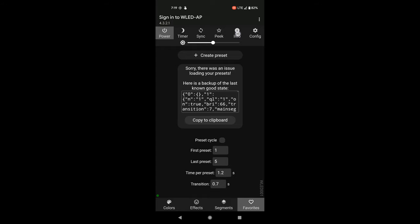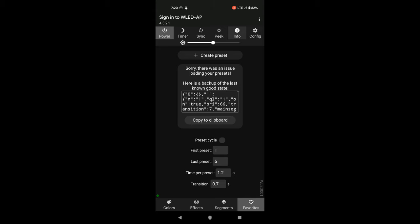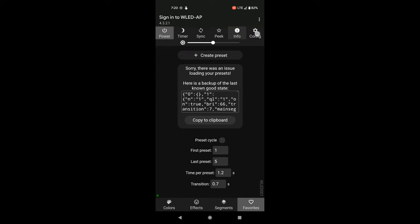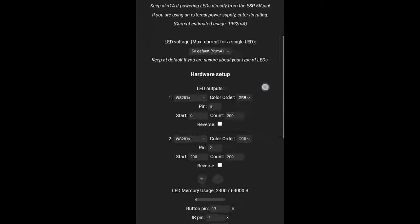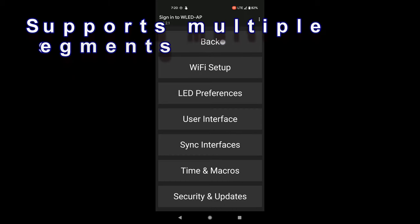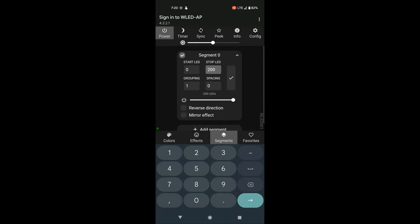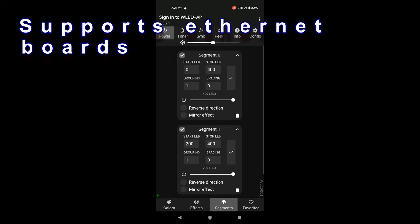The real power of this actually came about in April 2021 with the build of 0.12.0 Hikari, and it added three different features that make this a good addition to your home show. The first is it supported multiple pins — before the 0.12 build, you could only control one set of lights from one output pin. With this build, you can actually control multiple pins; here you can see I have two pins on pin 4 and pin 2 where I control a different set of lights. The second feature is that you can split them into segments, so rather than controlling a single stream, you can add another segment and run different patterns on different segments. The last feature it introduced is actual support for Ethernet boards rather than just wireless boards, which gives you the power for delivering data quickly and displaying it fast.